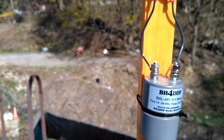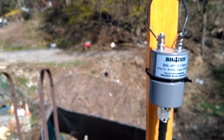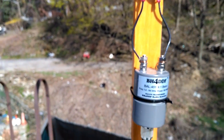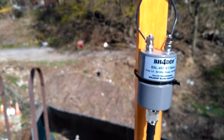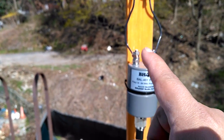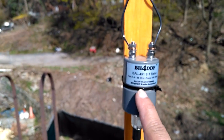I had it first without the balun, just with the standoff straight to the coax, and I was getting noticeably more noise. So I said let me try with the balun — thanks to Brian, he gave me the idea. And if you don't have the balun you can use a choke: just take the coax and do a choke coil to reduce some of the noise.